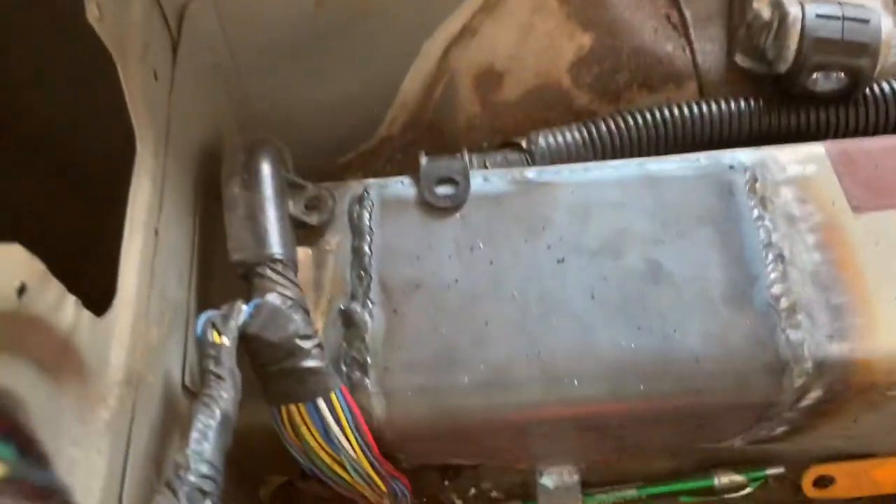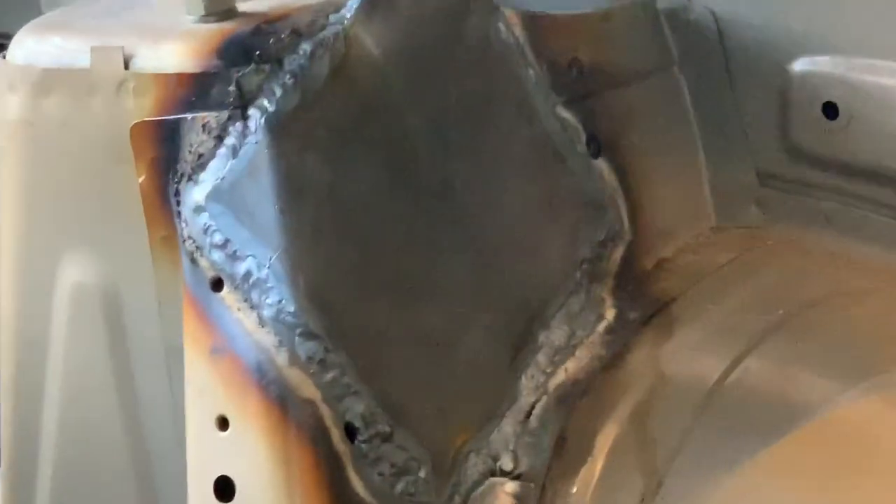We're definitely going to be working on this thing a couple hours a night until it's done because this is turning into an enormous undertaking. Matt came by and helped me prep some metal surfaces earlier, which helps a lot. I've got to get it done by next Friday because we're racing next Friday and we need a six-point roll bar. We got our plates welded in — some turned out pretty good, some not so well, but they're still good and strong. The rear pieces came along pretty well. Honestly some of the nastiest welding I've ever done — the floorboard kept lighting on fire even though I'd cleaned up six inches around the weld area, and every ten minutes I'd have to stop and blow smoke out of the garage.